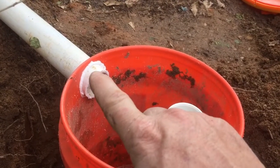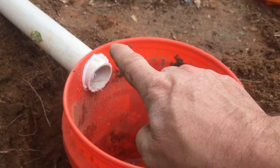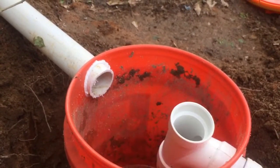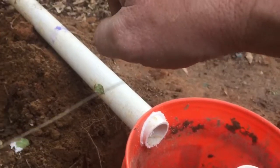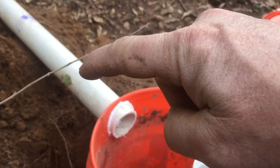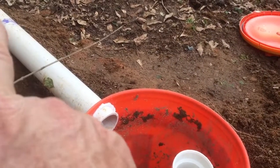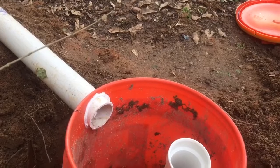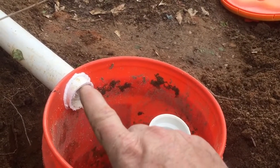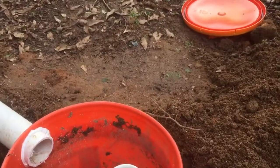Here's what I did: I got my hole saw close to the top — not all the way — I left about three-eighths to a half inch from the top and drilled my hole for my inlet pipe. Stuff is coming from the kitchen sink and going into the grease trap, so I drilled my hole as close as I could to the top. That's the inlet.